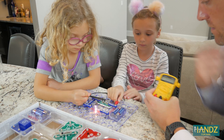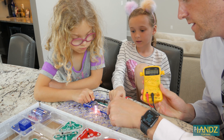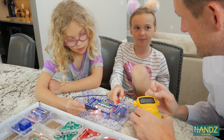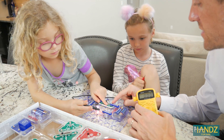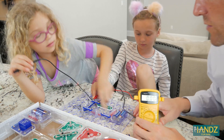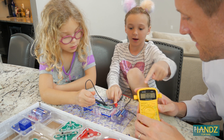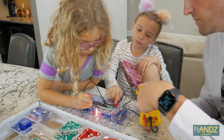Can you guys think of a way to force the electricity to go through the whole circuit? Trace the path of electricity — it's flowing through the light and then going back through here. But we're still reading zero on the multimeter. The issue is electrons are still choosing to flow through this piece right here. If we take this piece off, then it can't connect. Now with one lead here and one lead there, electricity flows all the way up and back down through the multimeter.